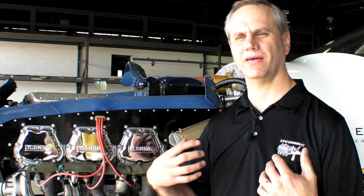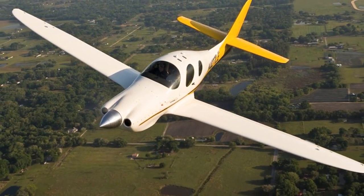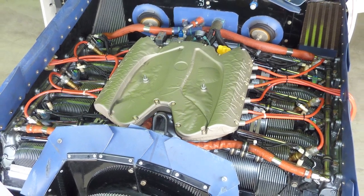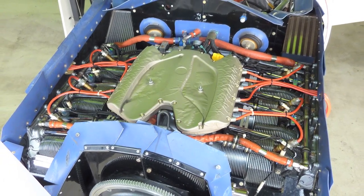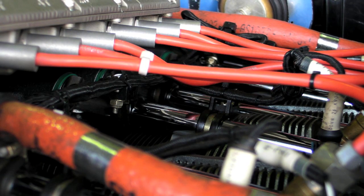The basic thinking is that Lycoming has very diligently mapped all the potential operating conditions for the engine — different speeds, different engine power settings — and we have selected the optimal fuel flow for those individual settings. On the aircraft we measure the amount of air going into the engine and using a map built into the engine provide exactly the right amount of fuel for that power setting. If a new certified fuel is produced for the industry, we can reprogram a different fuel map with the correct operating fuel flows for that new fuel, and with the knock detection built into the system it will be able to accommodate fuels that have a slightly lower octane rating while still protecting the engine from damaging detonation.